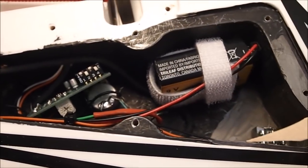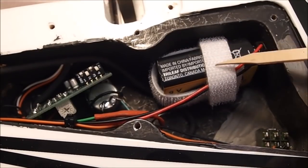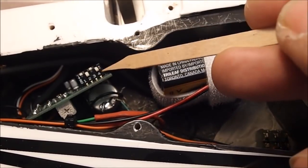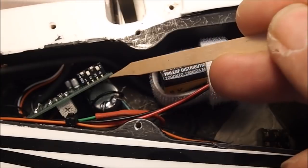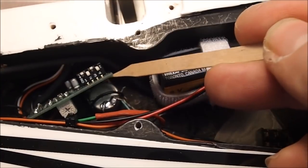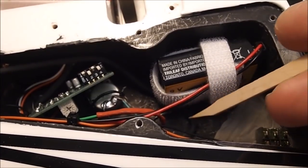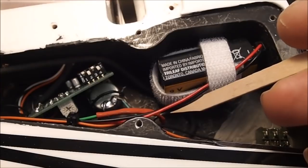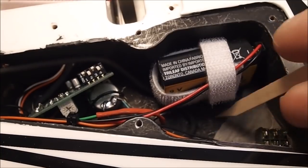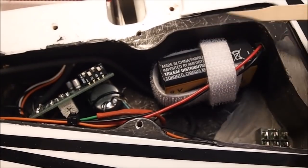The switch is in place and I found a spot for the battery — it's a tight squeeze. I went with velcro to hold it in position, because this guitar is fairly fragile in there; it's just relying on the lugs of the volume pot to hold things up, so you don't want the battery flopping around. Everything fits, all the wiring is fairly straightforward. I don't know if I'd want to do this in a guitar with more volume and tone controls — there's not much space left — though you could put a mini pot in there. Other than that, it's all set and ready to button up and give it a whirl.